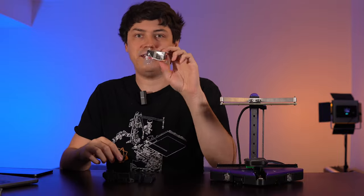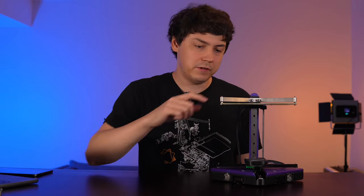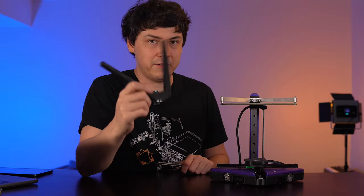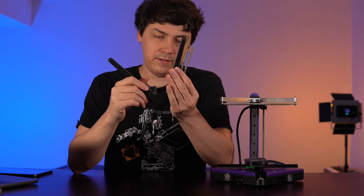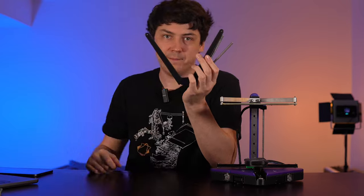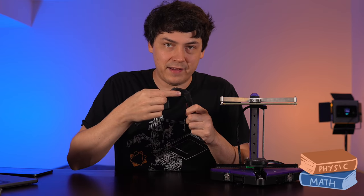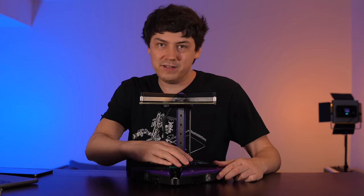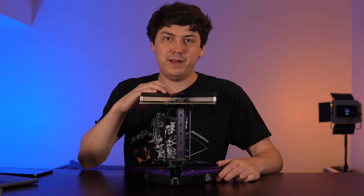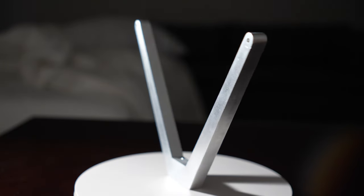The Positron 90 hotend is priced at $75, making it the single most expensive item. While I was waiting for parts to arrive, I also took care of one other thing that was a showstopper — the wobble on the bed forks. I had already gone and redesigned them, seeing as the bed forks should attach to the carriage and not some flimsy 3D printed bracket. My replacement design did exactly that — Limitron style 3D printed with embedded screws for reinforcement. But we have to talk about geometry: for all the rigidity in the arms themselves, none of it mattered because the torque from the embedded stiffening screws had no clear link to the metal carriage block — through the plastic — and the sheer distance between the big screw and the little screw was too much. I was so close to printing and all that was holding it up was having these forks made of metal. So I threw in the towel and had this piece machined. I knew it would push the project forward, even if it was predestined to become trash once a better solution was found.